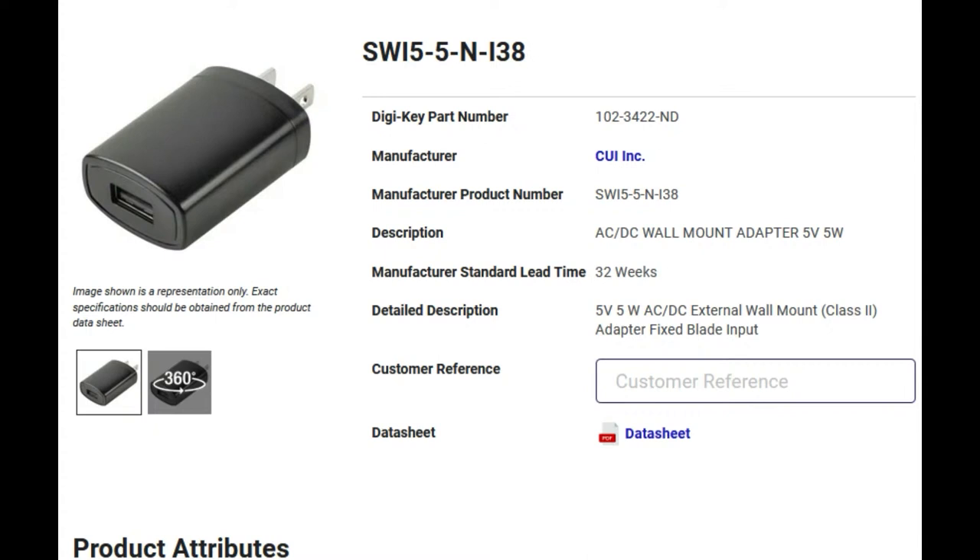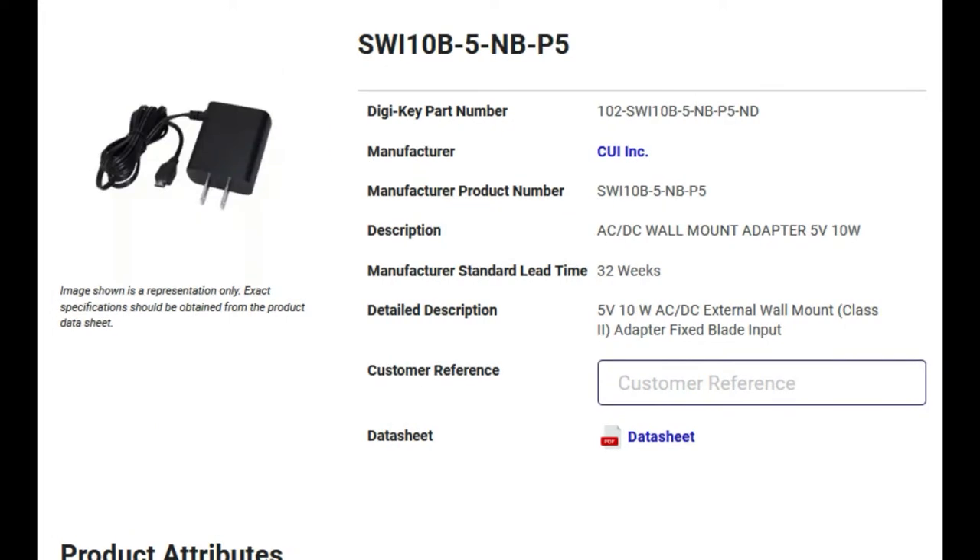Here's a CUI devices power adapter — nice and svelte, with an oval shape. You plug USB in and you can use this to charge. This was really popularized by mobile phones — everybody has a mobile phone, music player, GPS, watch, or whatever electronic device that you charge over USB or micro USB. You can get these with a micro USB plug. If you have a Raspberry Pi, you're well aware this is how you power it — or basically Arduino, whatever. This works wonderfully as long as what you're powering is five volts and no more than 10 watts.